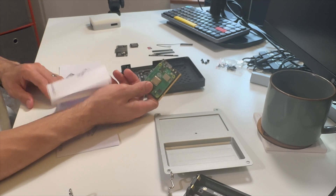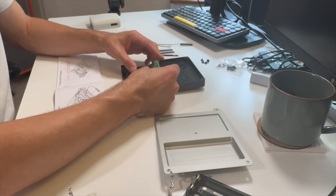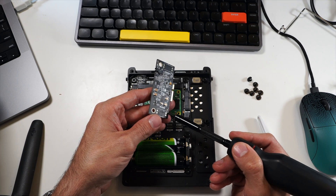Inside, the compute modules connect via a 200-pin SODIMM slot, just like a RAM stick. It has a 52-pin mini PCIe extension port, which is how it connects to cellular. One interesting design decision: it does have two speakers sitting in the back behind the metal, and those speakers only connect through the expansion board. So if you're designing an expansion board and you want to keep speakers, you have to design pass-throughs for them — which is a weird design decision.